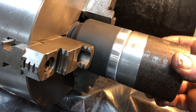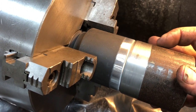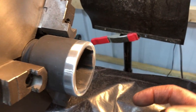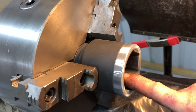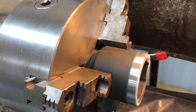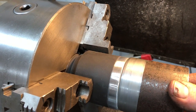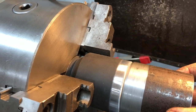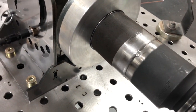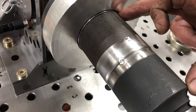The only reason I'm doing this is because there's a pin that goes through it — I'd rather put the pin through a piece of mild steel pipe rather than go through the short depth of this socket. So the socket is going to actually do all the work from the hexagon, and the piece of pipe is just going to carry the pin, which keeps this from falling off — it doesn't really help drive it, this is the drive. Here's what I got: this is the socket, this is the piece of pipe that extends the length — this is what I need.